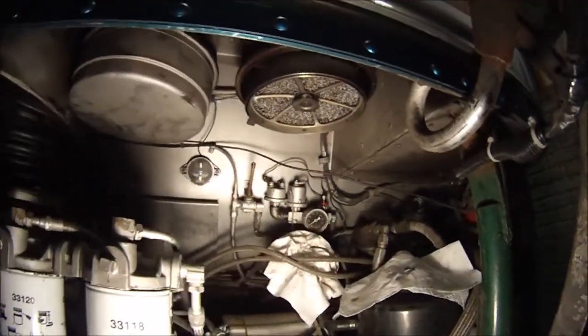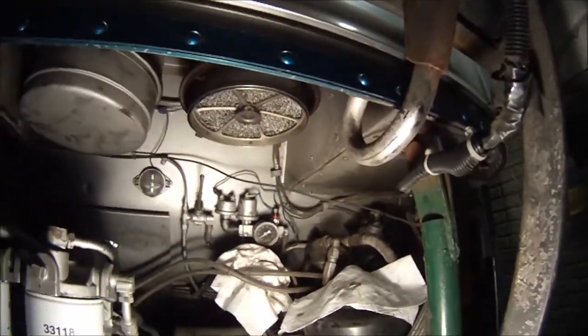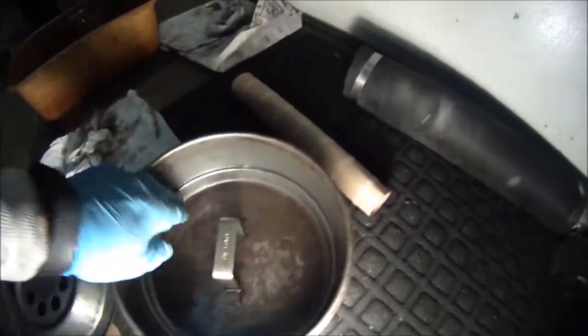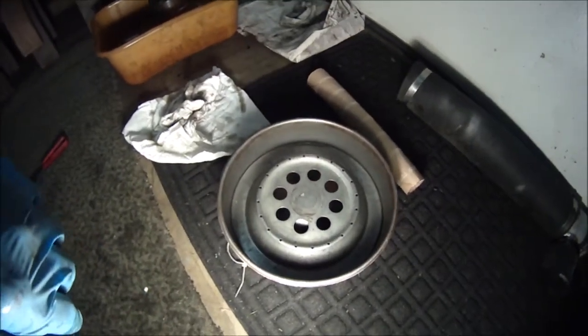Just a little lesson on air cleaners — I think the 4106 had a problem with this. You should clean them out every year or so and get the water out of them. Clean the dirt out as well. The dirt that collects in the bottom — usually you have to scrape the sludge out with a putty knife or whatever — then clean those things up and fill them back up with oil.